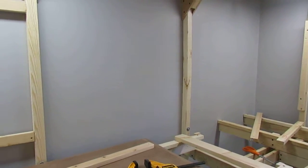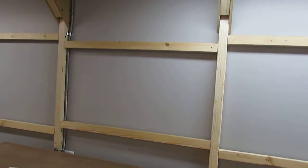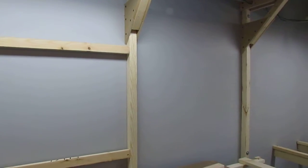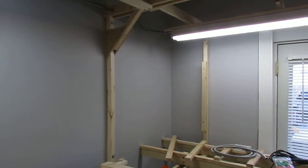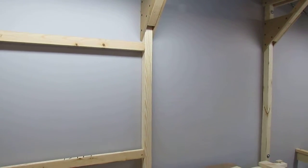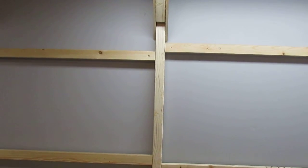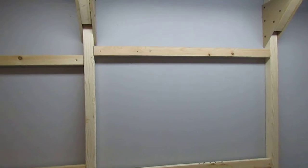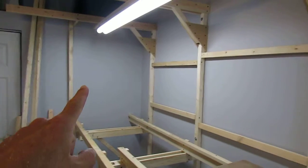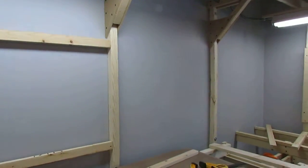And in fact, if I install the middle section here first, the 8-foot section, if I purposefully hold the 8 feet there, then I can just go ahead with the corner pieces with the 1.5-foot radiuses. So I'm probably going to do it that way, and the reason being is because I want to get the hardboard nice and level, and it would be a lot easier just to do a straight piece like that first and then work from that as my baseline, instead of trying to work from, say, this end down here and trying to go around the 1.5-foot radius and then come in this way with it. So that's my plan to install it.